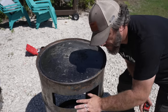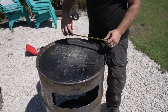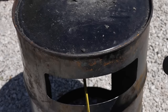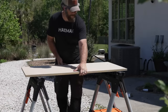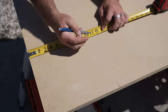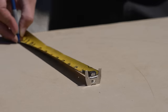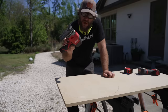Just below the opening is where the cement paver I'm going to pour is going to sit, so I need to know the diameter of the inside of the barrel, and I don't need to be exact. It's actually about 22 — we'll say 21 and three-quarters. Half of 21 and three-quarters is 10 and seven-eighths. I want to cut this circle out of this corner, going 10 and seven-eighths each way. You could cut this out with a jig on a router — that would be very simple and fast. I don't feel like setting all that up, so I'm just going to use my jigsaw.